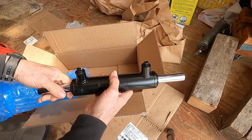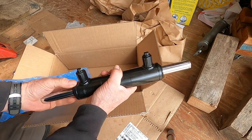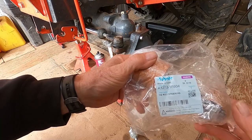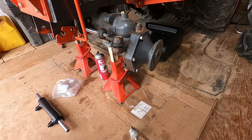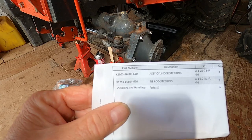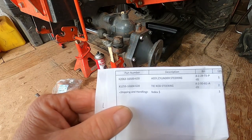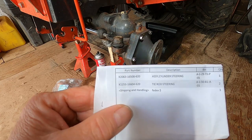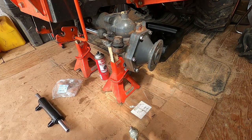There it is — the new upgraded steering cylinder. No more looking like a drunk person driving around the yard. For the updated tie rods, the part number is K1253-16604. Part number on the steering cylinder is K2063-16500-620 — I think the 620 is a common suffix because it wasn't on the packaging. Two tie rod ends, same left to right, and of course the steering cylinder.